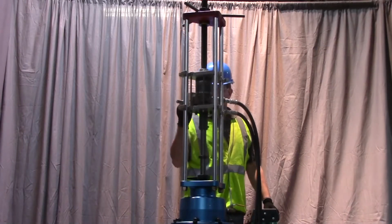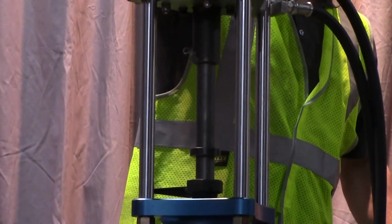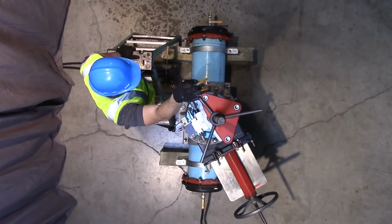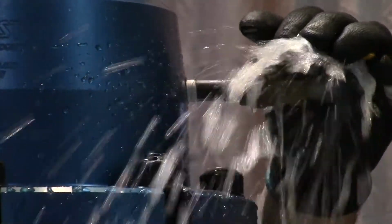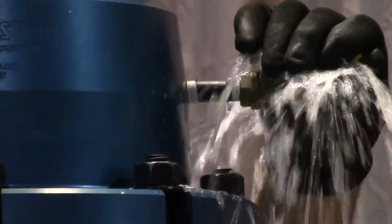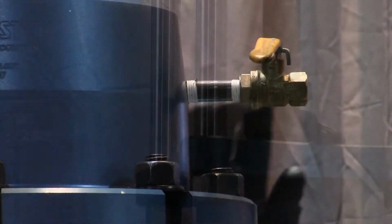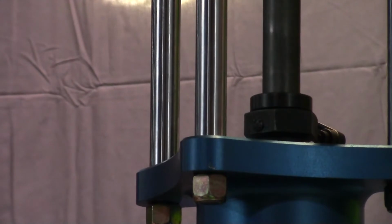Engage the drive unit and confirm the saw mandrel is rotating in a clockwise direction. Slowly turn the handle assembly in a clockwise direction, keeping slight, constant pressure. Close the ball valves on the P20 housing and the P2 housing of the Hydra-Tapper as water fills the housings and flows from the valves. The tap is complete when the stop collar contacts the packing nut assembly.